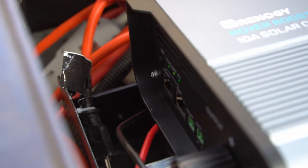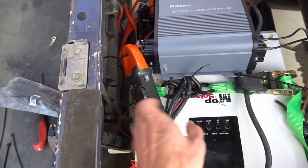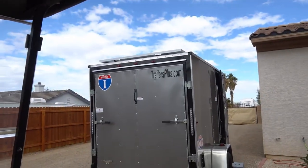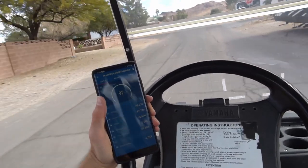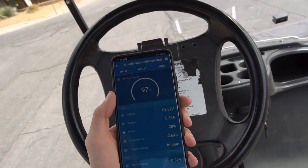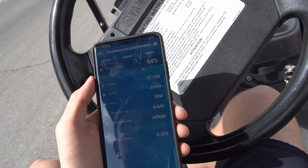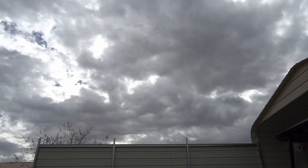We have green lights on the side and it is charging right now. The battery bank is at a high state of charge so I need to use some of the batteries to increase the charge rate. By the way, the solar trailer is powering my jacuzzi right now — it's been producing tons of power! We're charging with 21 watts currently. There are a lot of clouds but the sun just came out and we're producing 38 watts, which includes the standby consumption of the golf cart. Weather is getting worse so the max I can get right now is 43 watts.